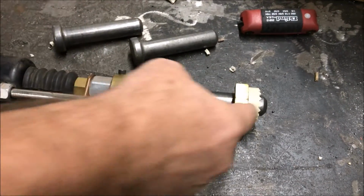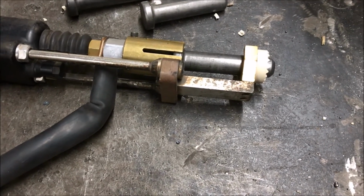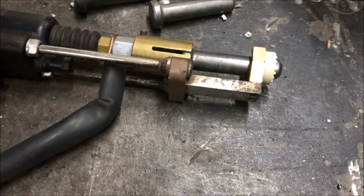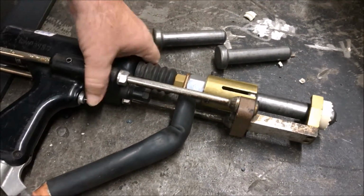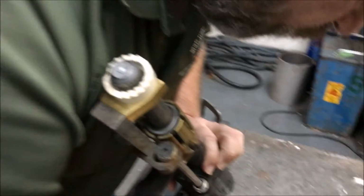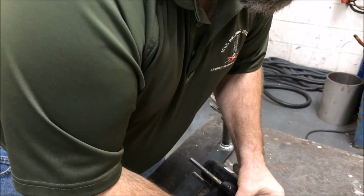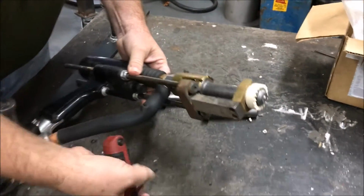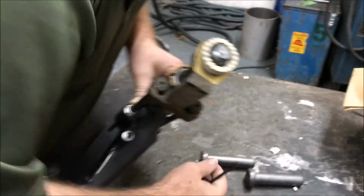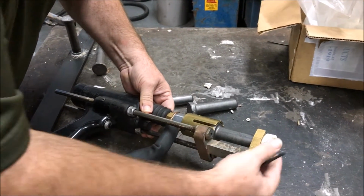Now, if I'm doing through deck, that's great. If I'm welding through deck, I want 3/8 of an inch. If I'm welding onto beams, I want 3/16 of an inch. So take a look here. You have these little side screws on each side of the gun, okay? Those are the set screws for the legs. So I'm going to move this forward some till I've got 3/16. And loosen that one up a little more. Start hanging on that leg. And right about there. Okay.